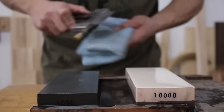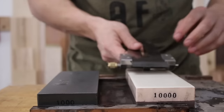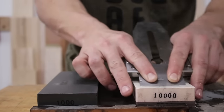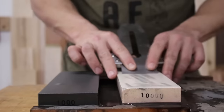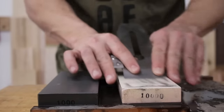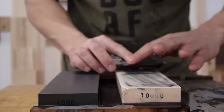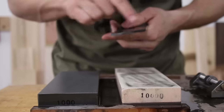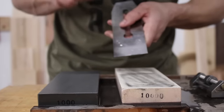I'm going to take a rag, wipe off my wheel, and without changing anything on this setup, go right to my 10,000 stone — maybe drizzle a little more water on there. I do the exact same thing, and I like to flip the stone around just to make sure I wear it evenly. I do the same cambering motion on the 10,000 stone, pressure on the left side then the right. The burr still feels good, so I pop the blade out of my honing guide. I now have a highly polished secondary bevel on the front face, but the back face is not yet polished, so it's not perfectly sharp yet.